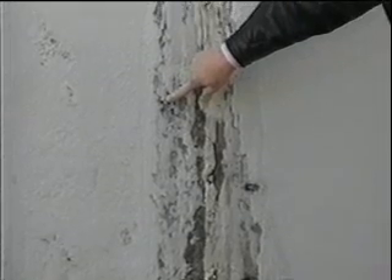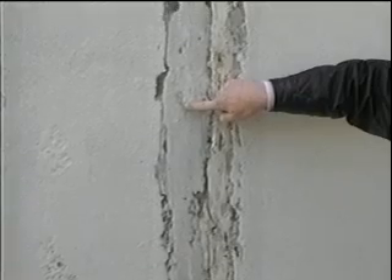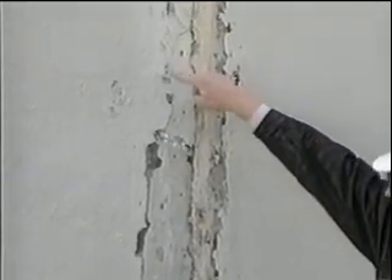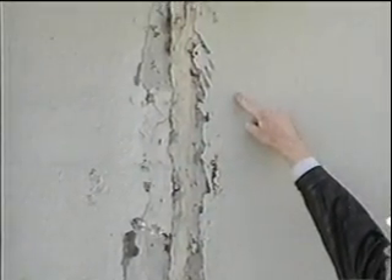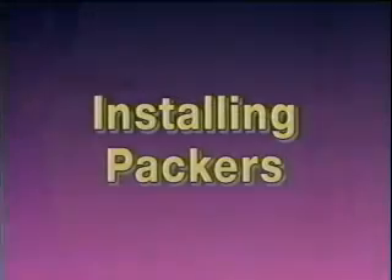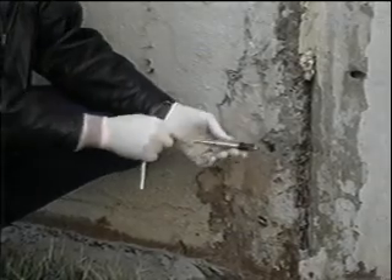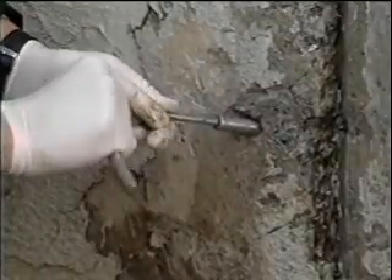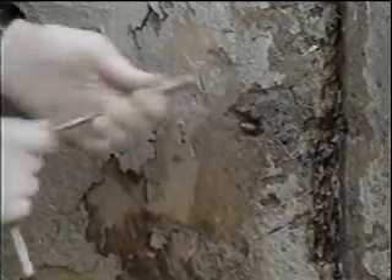Alternate sides of the crack as you drill each port. When repairing a concrete slab such as a floor, drill a relief hole a foot or so away from the crack. This will prevent too much pressure from forming under the slab when the grout is injected, which could cause lifting or breaking of the slab. Relief holes are rarely, if ever, needed on vertical surfaces. Sink the injection ports with a socket wrench — make them firmly secure, but don't over-tighten, as the packers can break. We suggest that you don't hold the ratchet by the end of the handle, as it may cause too much force.